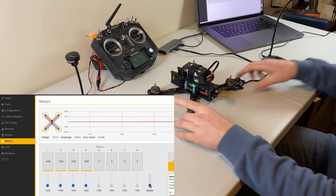Let's check that all our motors are in the right position. Motors one, two, and three are all at the right spot — I just need to fix motor four which was spinning the wrong direction. So I'm going to disconnect and close Betaflight, go over to BLHeliSuite, hit connect, and hit read setup. I can see all my ESCs — I'm going to go down to ESC four, hit reverse, and hit write setup. This will reverse the motor on spot four. Now I can disconnect, close BLHeliSuite, go back into Betaflight, go to the motors tab, spin up motor four again, and it's spinning the right way. We're all set with our motors.